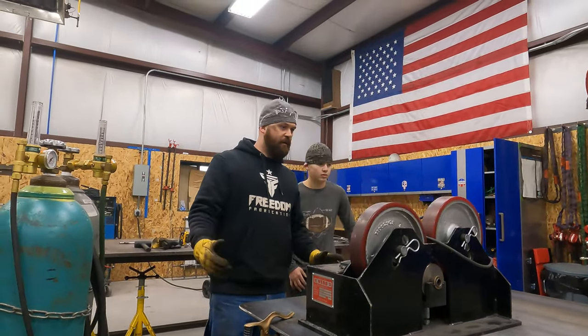Once they get the rollers bolted to the table, it's gonna take that warpage out and it's really not gonna matter. So hopefully you guys can understand now what's going on with the slots. So these rollers will bolt into the slots and then they'll be able to slide this idler in and out depending on what size roll they're putting on the rollers. That's the purpose of the table. So all that's left to do is a little bit of cleanup here. I'm gonna go ahead and hit this with a grinder, clean up the top of the table again, and we'll go to that point.